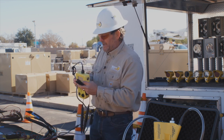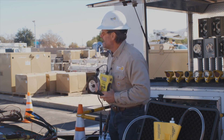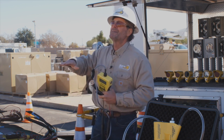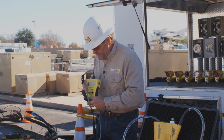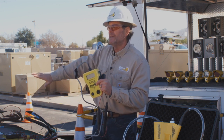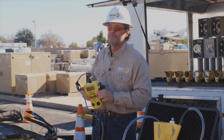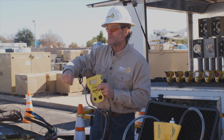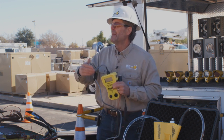We turn it off and go to hot leg one and hot leg two. Turn it on and look at the voltage — we see 240 volts. We're hoping the integrity on our hot legs is good and the issue is just on the neutral connection. We're hoping to see 14 or 16 amp jumps. We go to the load and sure enough we see 14 amp jumps. It gets up to 800 amps, stops counting — maybe at 60 or so — and holds. That means your hot legs are golden.